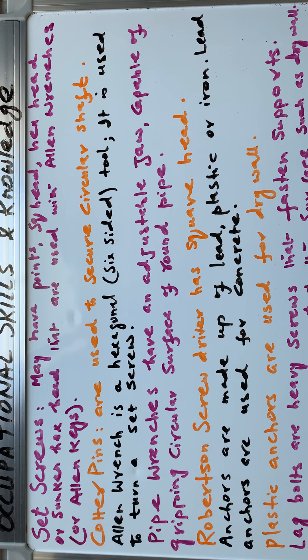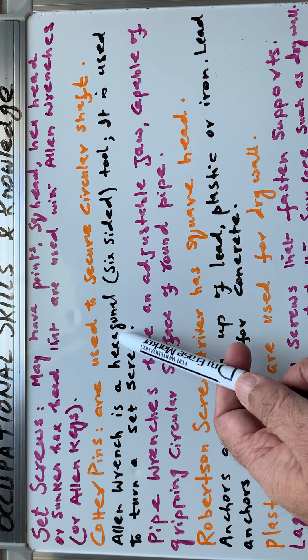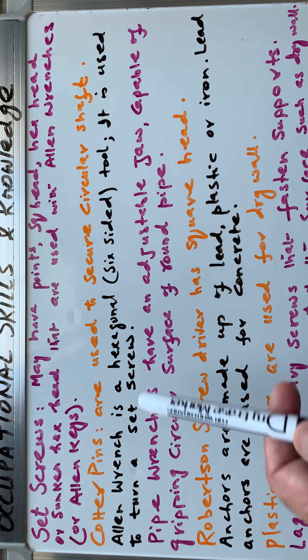This is what we use mostly in our occupational practice. A millwright, technician, or gas technician wanting to put the pulley onto the shaft has to check the threads, determine what type of allen key will fit, and what type of set screw is given — then choose the correct allen wrench accordingly.